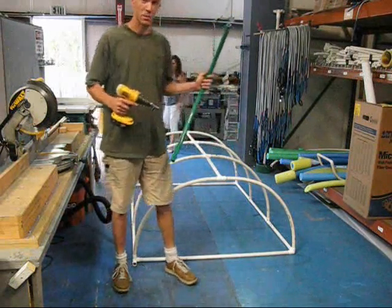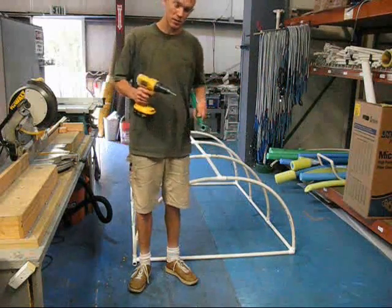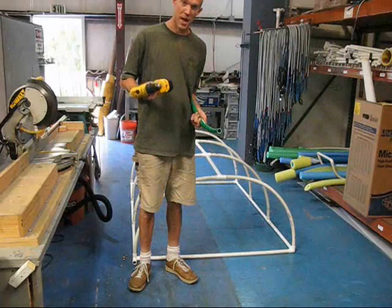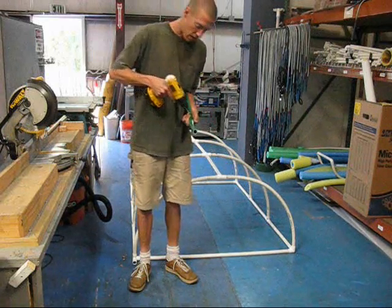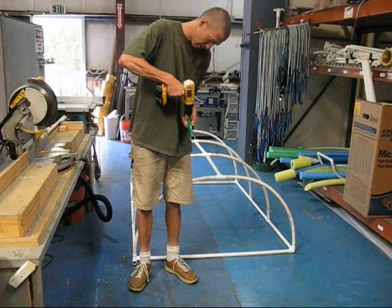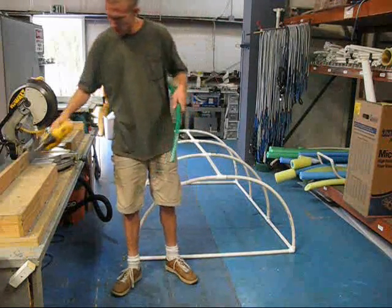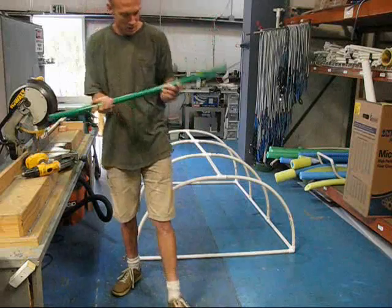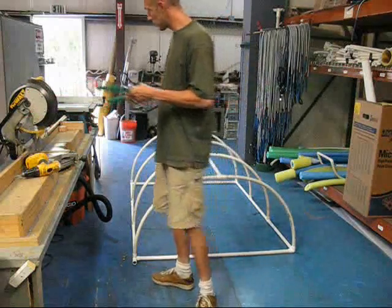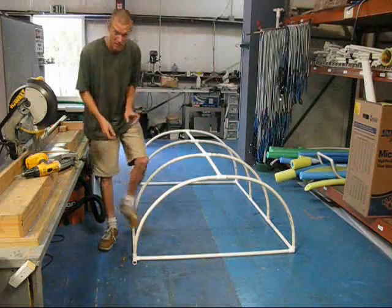That is the basic assembly process. Now, to prepare this to add the spray nozzles, I'm using a combination drill, tap, and deburr tool — you can also just use a tap and die. Make sure you match your thread count, and then you have a perfectly tapped hole to put the nozzles into. The next step is to add the nozzle.